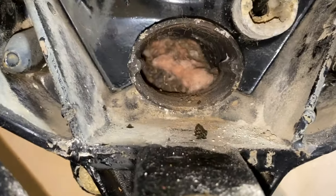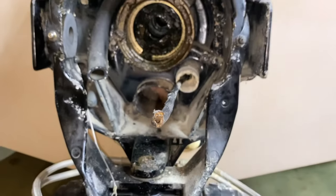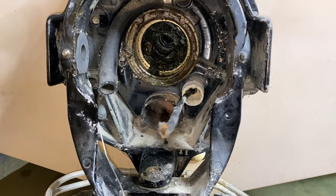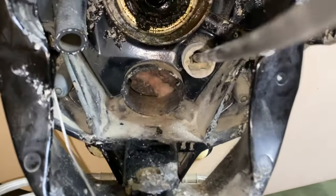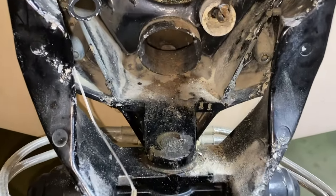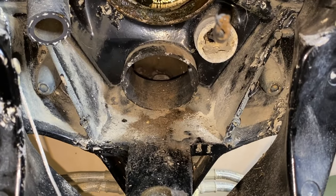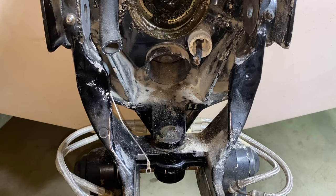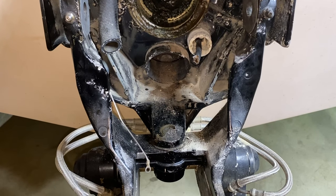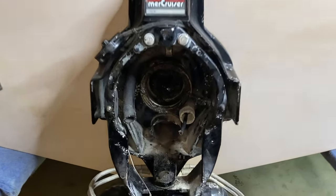This is what I'm worried about — all that insulation inside the exhaust. From what I can tell, there were no holes in the actual exhaust bellow, so unfortunately something got inside and created a home over the years the boat was sitting. We need to clean that up. I've removed as much insulation as I can get a hold of, and there was a lot. Unfortunately it continues inward and up the exhaust pipe on the inner portion of the hull. We need to clean that out — the last thing we want is to get everything rebuilt and start the engine with a clogged exhaust pipe.